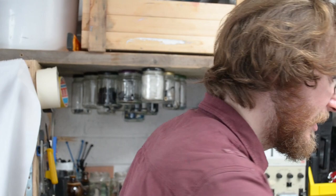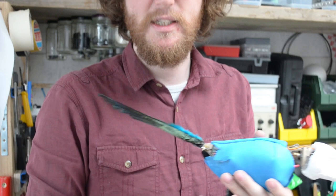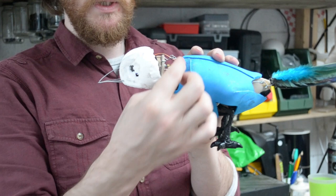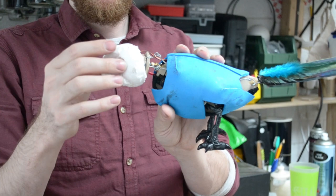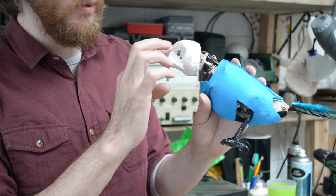So this is the greatest thing in the world. He learnt from Adam Savage's videos. He's getting there — he's now got a body made of thermo foam. There's a million different brands, it's just foam you can squish when you heat it up. I've been using a space heater to warm it up and mould it into a nice round shape whilst cutting chunks out so it can stay like it is. Making sure to cut out areas for the levers to come out. This is all going to be covered with fur that's very loosely attached so everything can move. I've also stuck some foam on either side of the servo in the head so the head's a bit more press-fit. I need to work out what I'm going to do for a beak and I'm probably going to get some marbles and do something fancy for eyeballs.